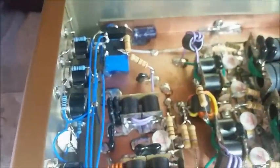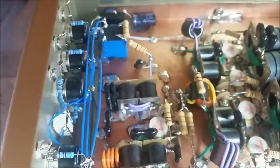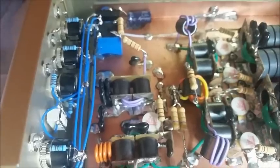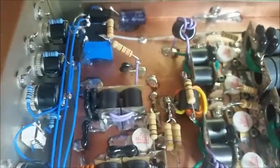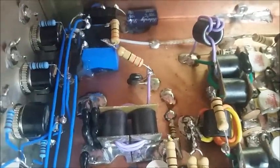I had to retune the input. There was a little bit of reflecting there, probably due to the extra wiring that's in here now on the RF going through the high and low switch and everything. It needed to come down like 10 more picofarad, man. So we got that thing tuned out real well for you now. Output is great. In between is great.